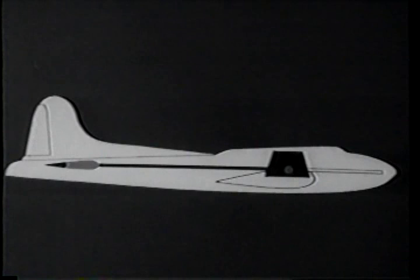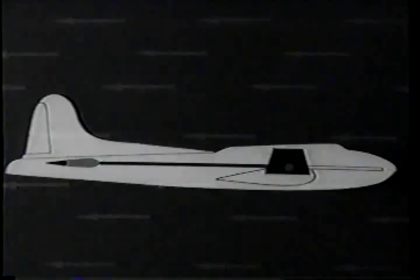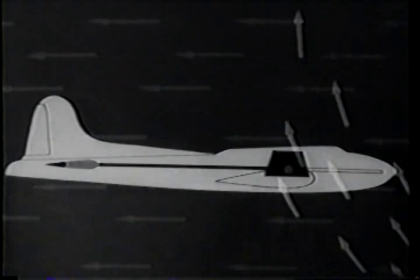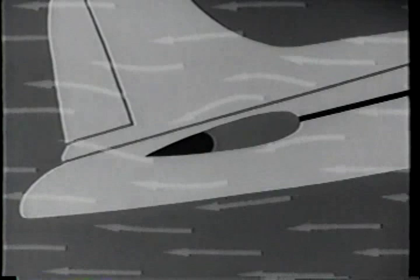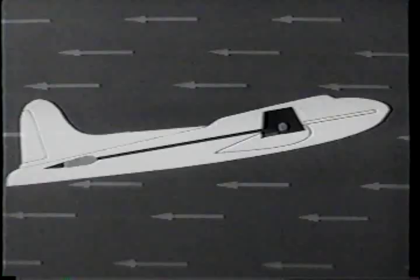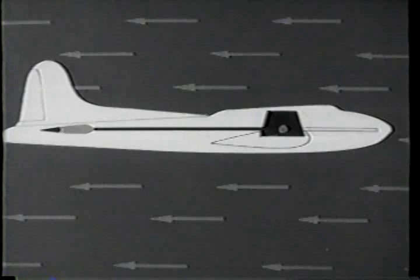With the airflow around her, center of gravity becomes a sort of pivot point. The airplane flies just as though she were suspended from a rod across her wings. Trim your airplane for level flight and she'll hold her own. When a gust hits that wing, causing it to rise, pushing her nose up, the stabilizer's angle of attack increases. They grab a little more airflow, and that small added force multiplied by all that leverage is enough to overpower the wing with all its added force. The airplane restores to trimmed attitude and trim speed.